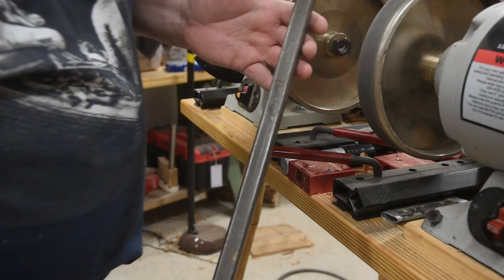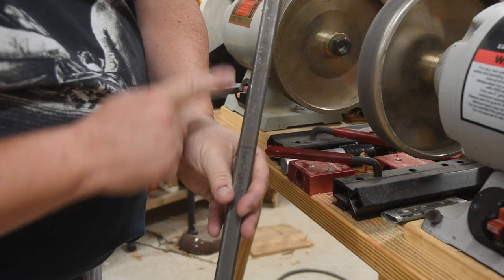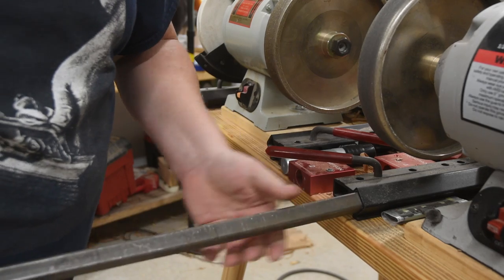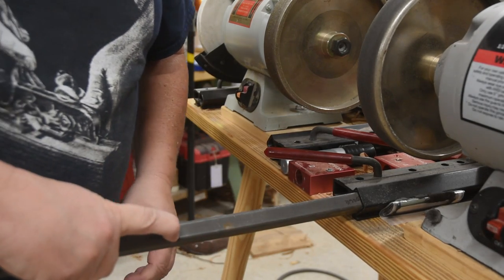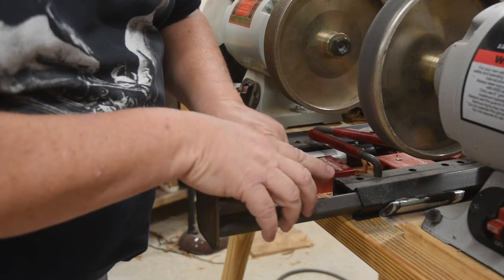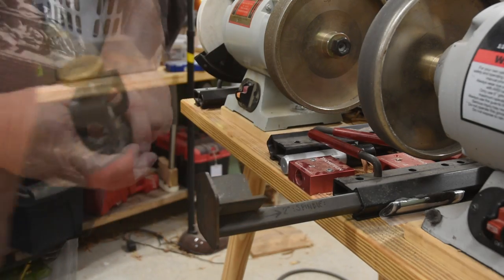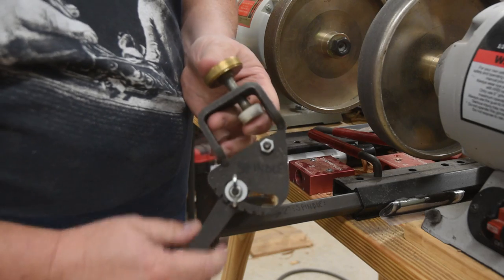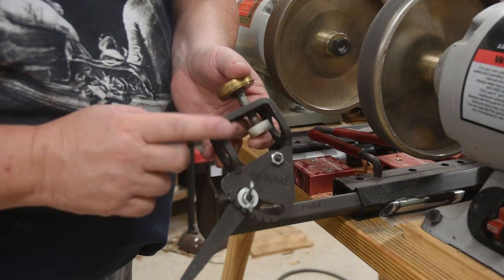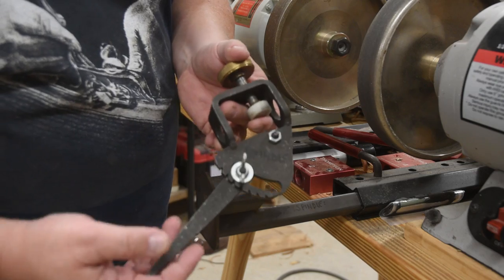With that same idea, the bar that comes with the Wolverine setup — this one's way too long, but you'll notice I have lines marked on it. My roughing gouge mark is here, bowl gouge is there, spindle gouge is here. Whenever I want to do a spindle gouge, I bring this up, drop my finger on that line, and my settings are always the same. If you ever need to change those settings, since I use a Sharpie, just a little alcohol takes it right off. Because my spindle gouge settings — the ones I like — might not be perfect for everybody. I bought one jig just for my spindle gouge and haven't changed that setting in probably eight years.